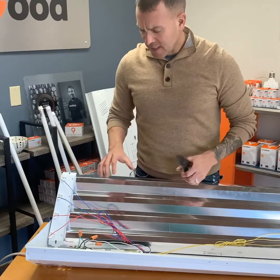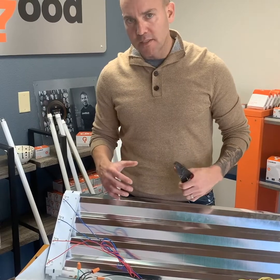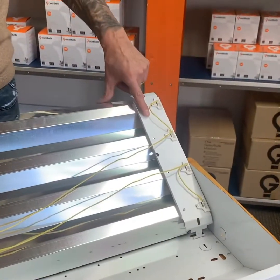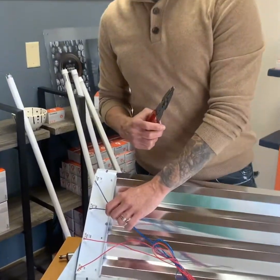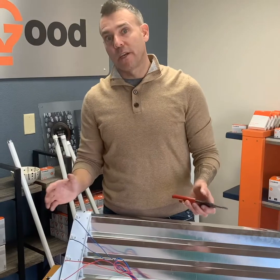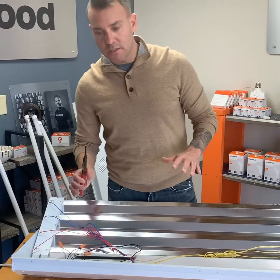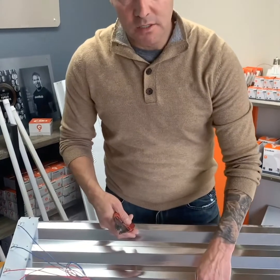The fixture is ready to go. This is a really easy fixture for this demonstration. It was set up for fluorescence and it is set up for a double-ended tube because you have power coming into one side. If you follow the yellow, you have neutral going into the other side. You have two reds or two blues here. When you make this transition to LED tubes with a double-ended fixture, color doesn't matter anymore — the only thing that matters is that you have hot on one side and neutral on the other. We're going to start cutting wires. Before you cut a wire, make sure the power is off. The last thing anyone wants to do is get electrocuted.